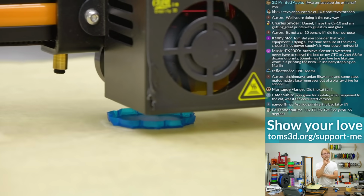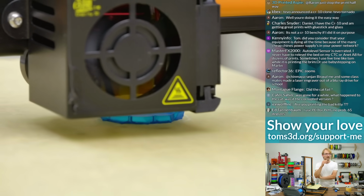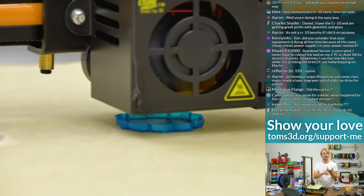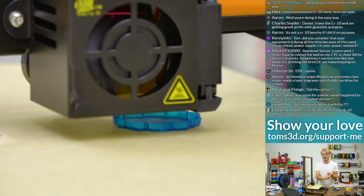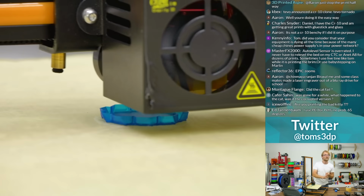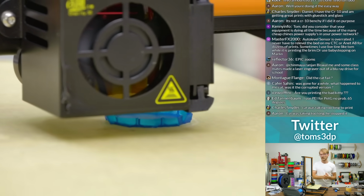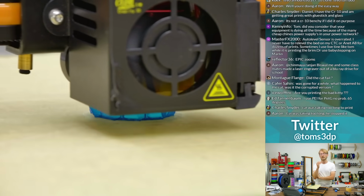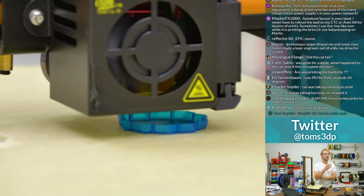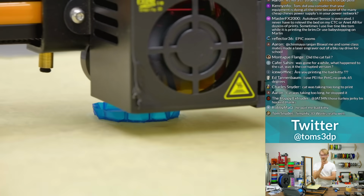what Slic3r really doesn't do well, and Simplify3D is only now catching up to, is dual material support, as in PVA plus PLA, all the features you need for that, and some features that I needed for a client specifically for investment casting that saves a lot of print time and a lot of material, as in variable infill and all those special features that Cura 2 has, where Slic3r or Simplify3D just can't keep up with. Everything doing it automatically.